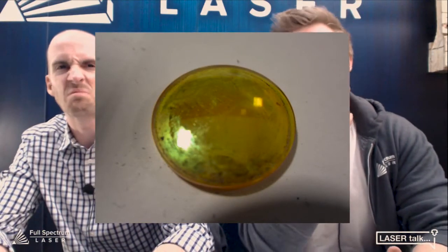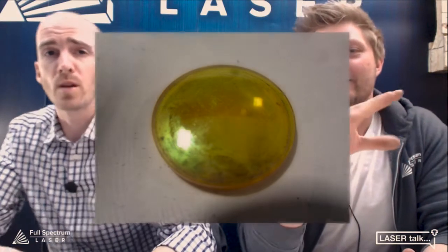Once buildup starts occurring on your lens, as that beam and power passes through and hits small debris, it's going to eventually ruin your lens. Here's a lens that's just dirty — that one needs to be cleaned. This next one actually cracked as a result of having so much buildup that it kept holding all the heat. You can tighten that ring too much and it cracks. Sometimes you can barely see that crack, you put it back in, and this is the result.